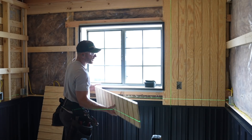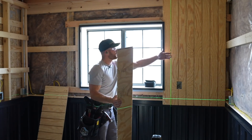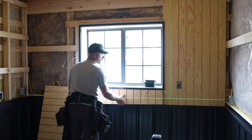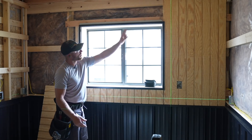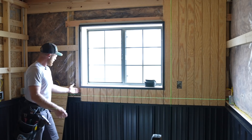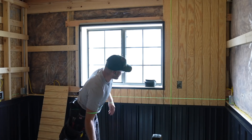Now what I was able to do here was - because these are four-foot panels and this is a four-foot window - I was able to run this piece into the window and save myself a whole bunch of material, basically gold, because lumber is so high priced. Just getting the cut-off rips and cutting it down to a top and bottom piece, and then coming out of this with a full four-footer. So it's going to work out pretty good.